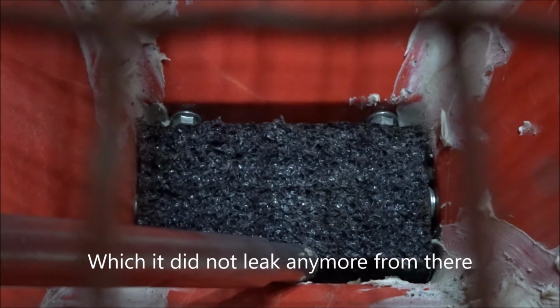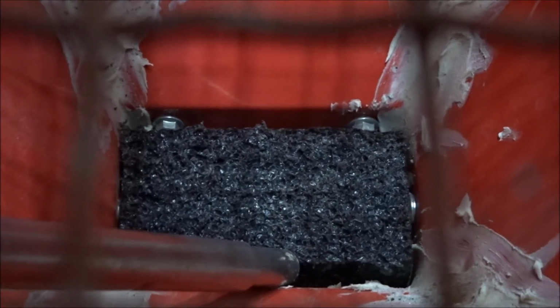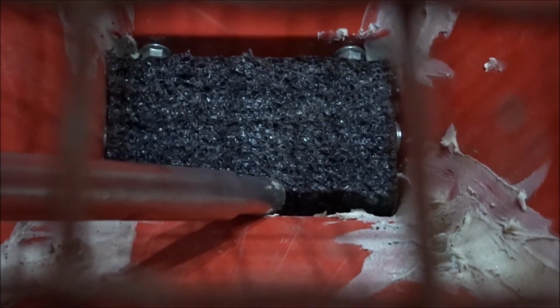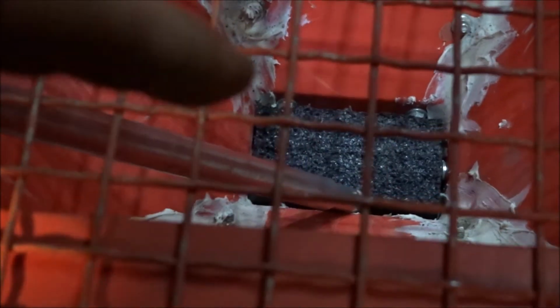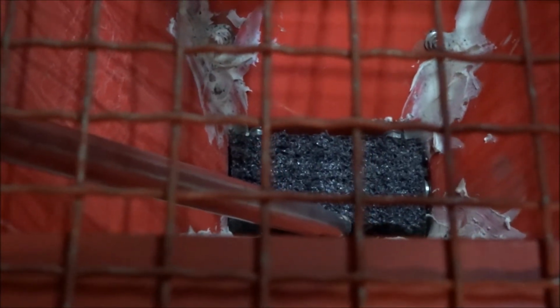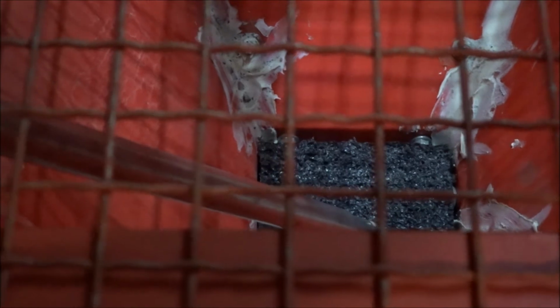The other thing I do is I put this little foam block at the bottom. Since that's as far down as that hose can reach, there's really no sense in having anything deeper than that. The volume of that foam is stuff I couldn't use. Right, so anyways, I've been doing that. It seems to be fine. It seems to help feed and distribute the sand where I need it, or the blasting media.